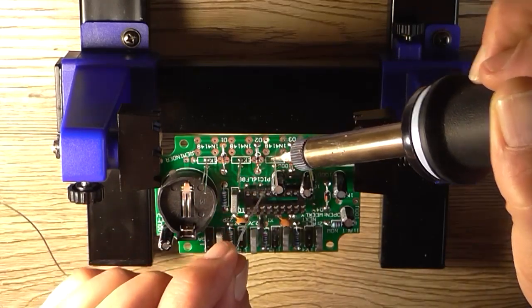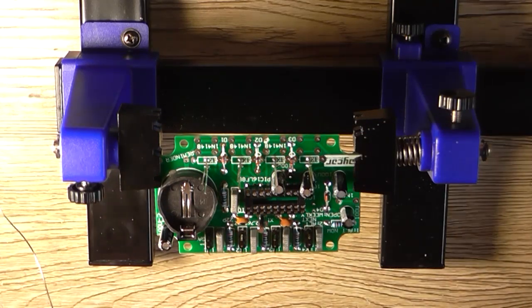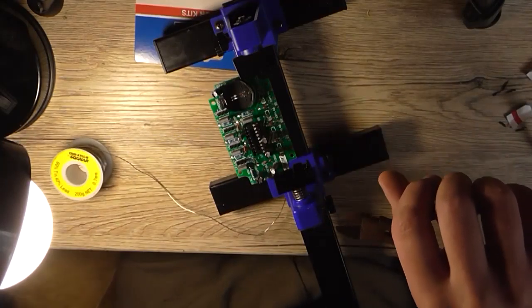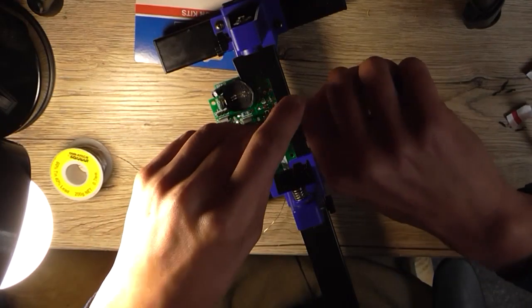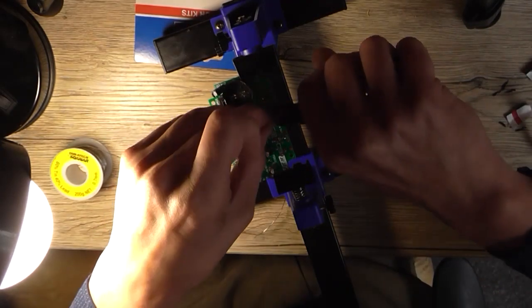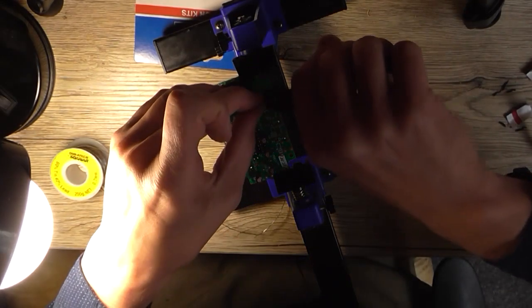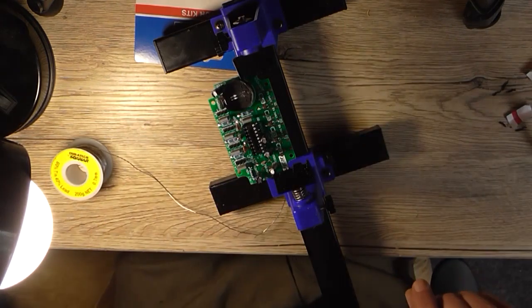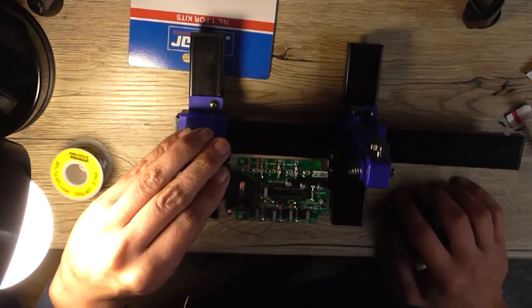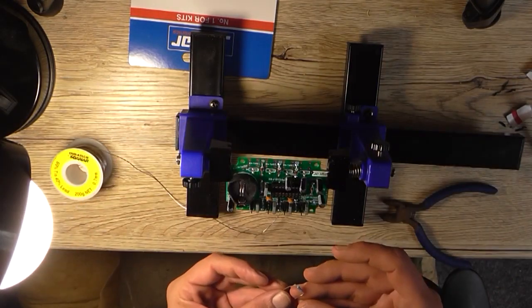Don't forget to solder the pins you tacked in, or else you're going to end up with a bad joint, and of course clip off the excess. With the capacitors and diodes and stuff now already installed, it does make this awfully difficult. It would have been nice if they'd reversed the instructions a little and made you do this task first without everything else in the way, but they didn't. So then I guess the next step would be to put the 1Ks in now that we can.